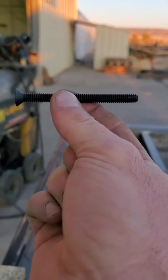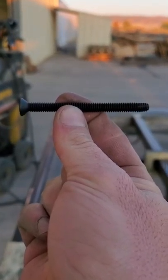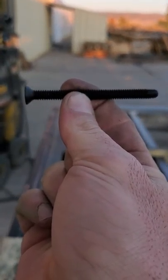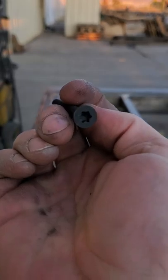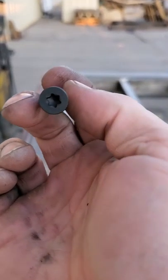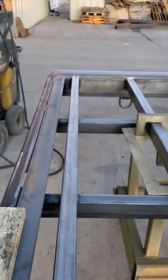You can get those at Fastenal or Redneck Trailer Supply. It'll be a TRX or a truck bed screw — TRX 250s. I think this is a TRX 250 from Redneck Trailer Supply, and they ought to be able to source that. Tell them it's a truck bed screw or a deck screw Type-F with a Torx T30 head. This is not a Phillips and it's not an Allen screw — it's a star bit, but it's a T30 Torx size.